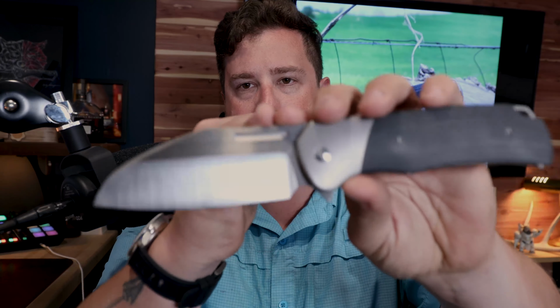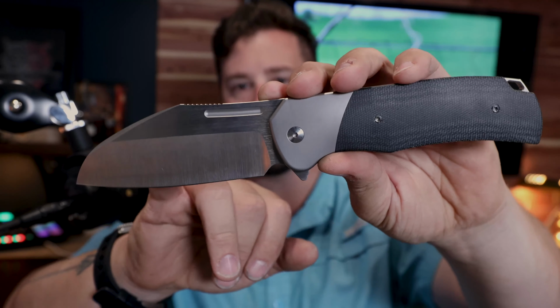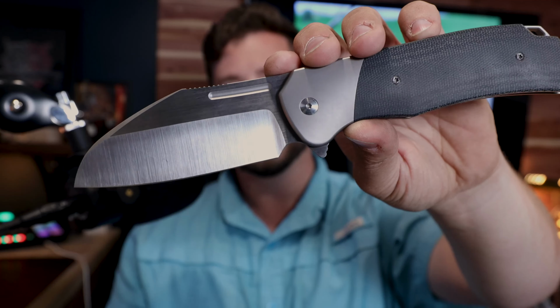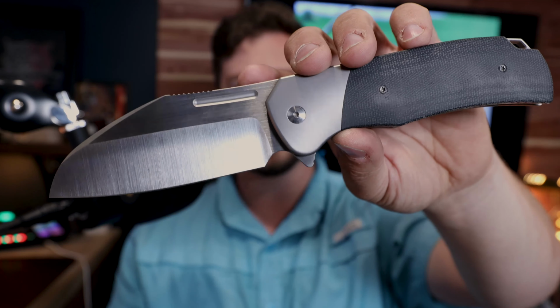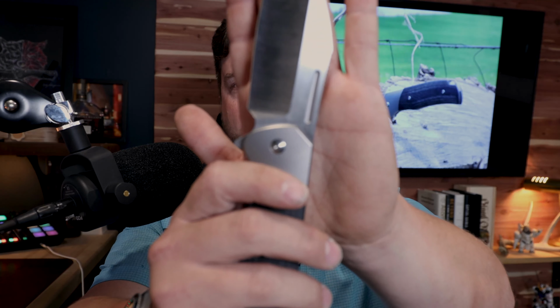So this is the very first prototype that I've received from the factory after submitting all of my drawings and schematics. One of the misunderstandings between the manufacturer and myself is I had intended this to be a full cutout with a stair step jimping going down into an open cavity. Either my two-dimensional drawing may have been somewhat lacking and given a misrepresentation, or one of the hand-drawn sketches that I had provided to them at a later date might have done so. But they just put a single milled fuller, doesn't go all the way through on both sides.